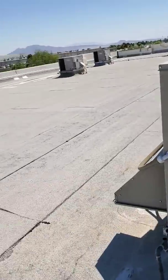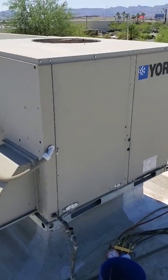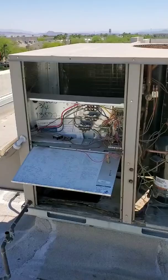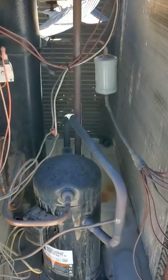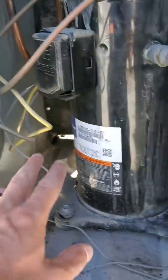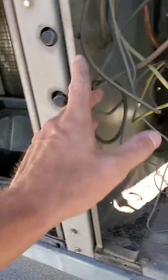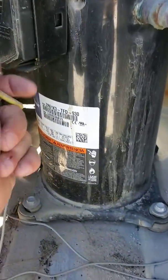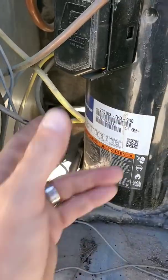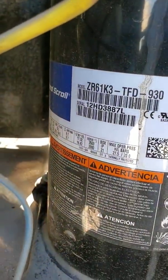I've got it all opened up now. This is your compressor compartment. While it's running, I would not open these ones quite yet, but I'm just going through each one. This one here I would check amps - you take your amp probe that sits around this and check and see what your amps are. Then you can actually look on your nameplate and it'll tell you your amps on your compressor. So you can actually know if it's 40 amps, 30 amps, 20 amps, whatever it is.